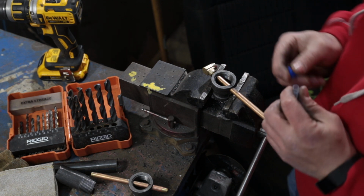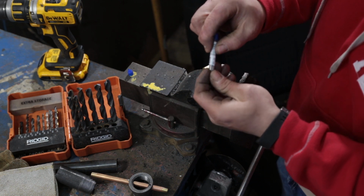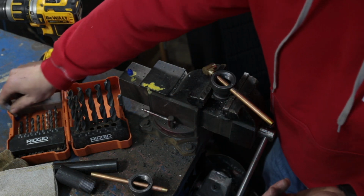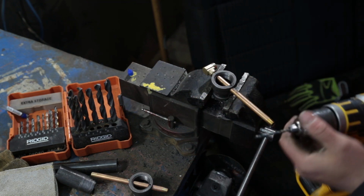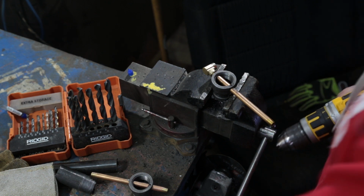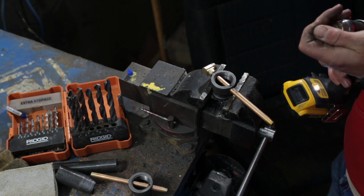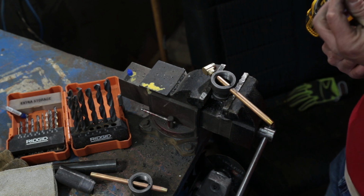We're going to drill that burner hole now. Your burner hole is going to be tiny. That's going to be a number 57. Number 57 drill bit. It's not even in inches. It's a number 57. This thing is minuscule. You're probably going to have to buy this. Get it on Amazon. You can get it cheap. Buy more than one. Because I haven't used one yet, but I have a very sneaky suspicion I'm going to break it. I can't even get this in here. This might be an issue.